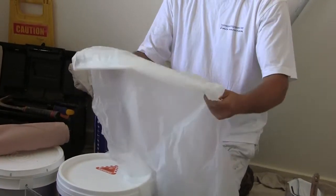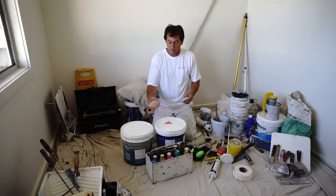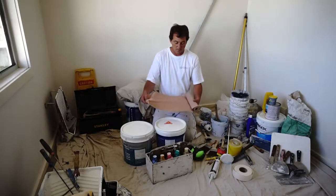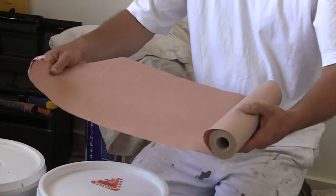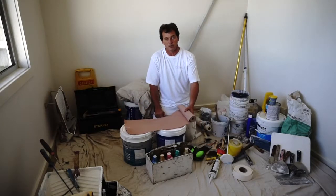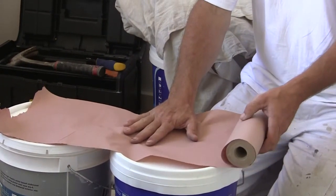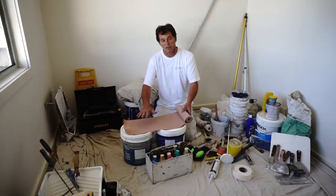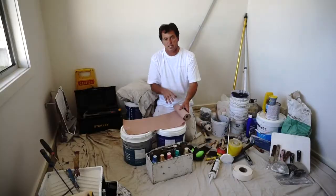It can be an inexpensive way of covering up — waterproof but lightweight — so you do want to make sure it's stuck down properly. You also get small rolls of paper for the same thing. Sometimes you can't put the drop sheet under all the tiles, so sometimes these taped around the edges will stop you getting paint on the tiles. It takes about 10 to 20 minutes and a few dollars. Or a newspaper — you can use exactly the same thing, just use a lot of it. Stick it down, take your time.